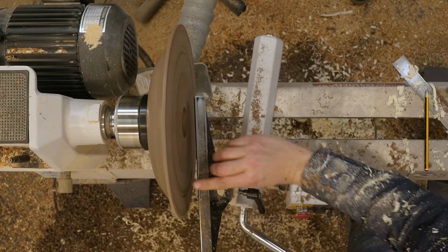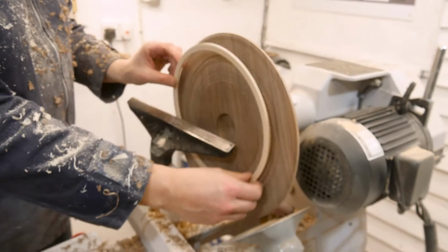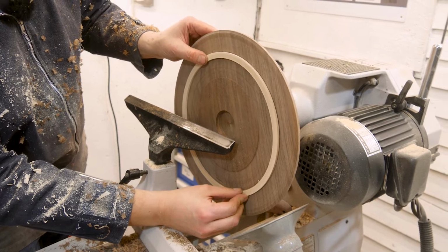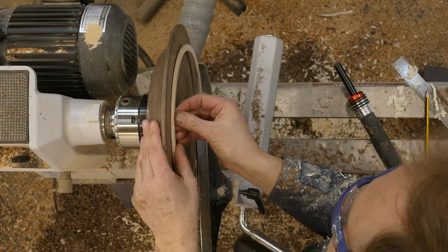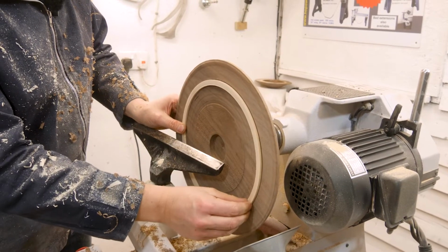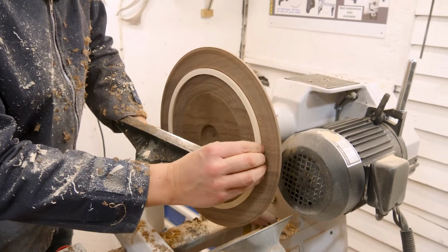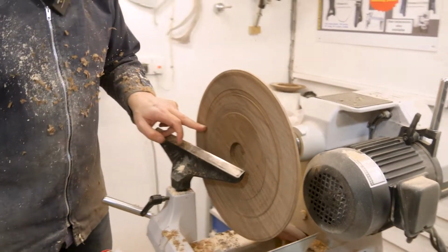And also I put a slight taper also. So remember your crosses that go this way, and we can see if this starts to fit. Okay. Yeah, it's just starting to go in. That's quite close. We just need to make it slightly wider. Sometimes you have to look to see if you need some on the inside taken away. Sometimes you need some on the outside taken away. In this case, I believe it's some on the inside, so I'll just make a small adjustment.